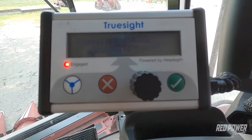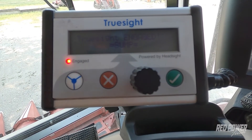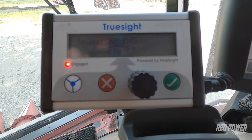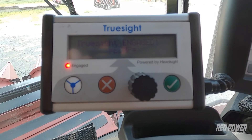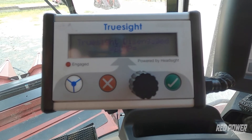After we've calibrated that set point, now as you hit your auto resume, you should notice that after it hits that set point, you're going to see the engage light light up on the TrueSight 2 box after two and a half seconds. As we raise the header and it goes above that point, the system should disengage. Once the header raises above your stop point, it's going to disengage the system. You can also disengage the system by grabbing and turning the steering wheel. This is how we set and calibrate our automatic engage feature in the TrueSight 2 row guidance system.